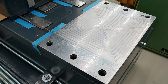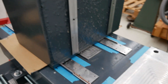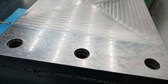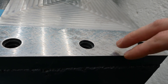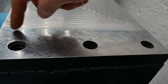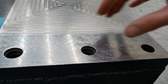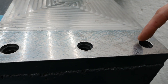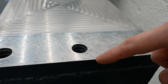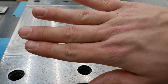This is the first print with the column standing there. I'm not sure if you can really see it on the video, but on this surface there is a very blue stripe with a lot of bearing points, fewer bearing points in the middle, and none on the side. So this surface is tilted in this direction.